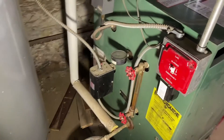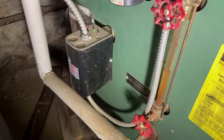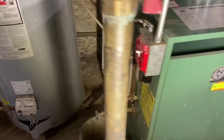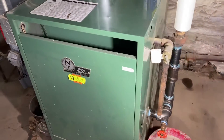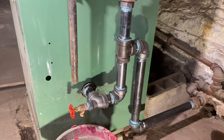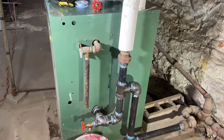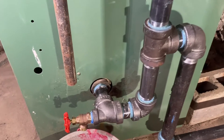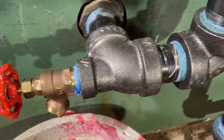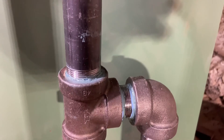I put the switch on, had the boiler cycle, it filled up above the low-water cutoff, the boiler came on, and soon thereafter it started to reach pressure — that's when I realized the drain cock I'd left on the return was leaking. I shut it off, went back and replaced it. Everything else was good. You'll see when the Blue Block kind of starts to cook — it bubbles up. You can see the new drain cock there after I had it back on. That's what happens when the heat gets to it.